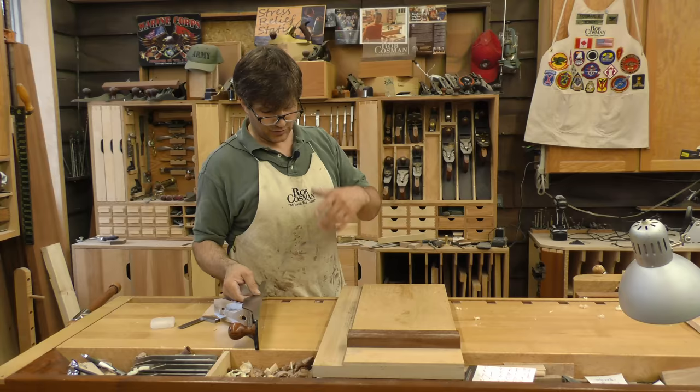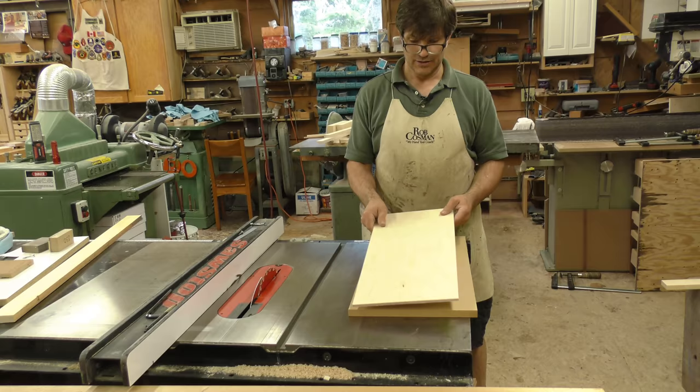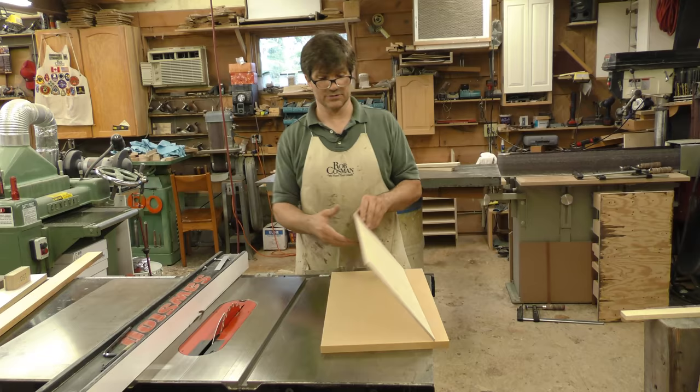The rest of the stuff we'll show you as we go through this, so we're going to move over to the table saw. Here are my two pieces that I need — my MDF, and I'm actually making this one out of three-quarter inch; I don't have any more one inch. There's my piece of Baltic Birch. Now it's sold as three-eighths, but it's Baltic Birch so it's metric. Actually, that's coming in right at a quarter, so maybe it is sold as a quarter.